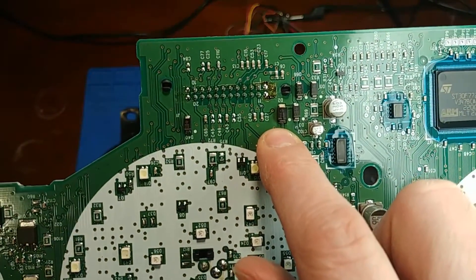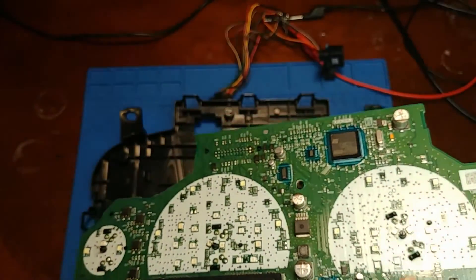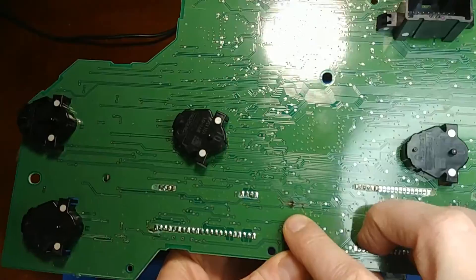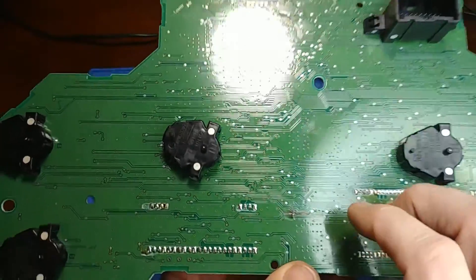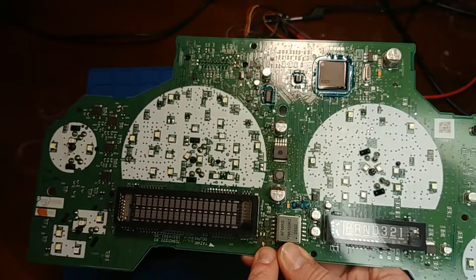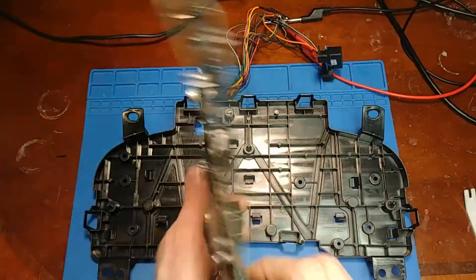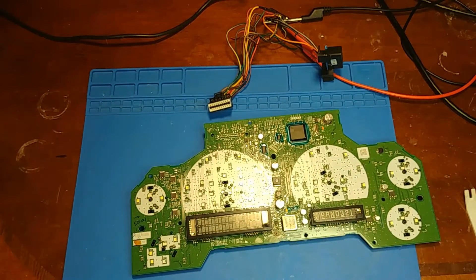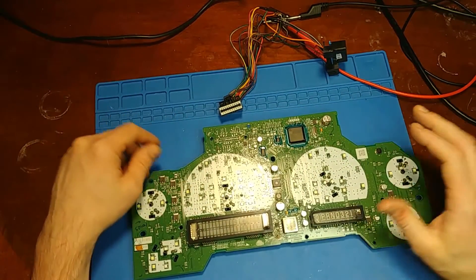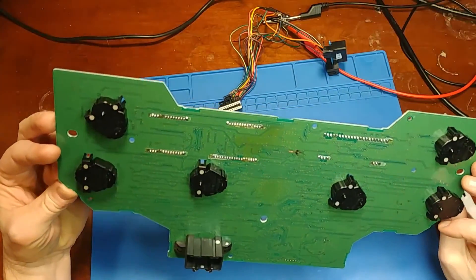I also see that the diode has split. So if you're replacing that, check out that 100 ohm resistor — it likes to take some abuse. Look at that — we have some blown open foil, got some foil hanging. I wonder if he accidentally caused a short and that's what caused the excessive current. Under normal conditions when this blows out it usually doesn't take out the diode and usually doesn't blow open foil. Normally the MOSFET shorts out and blows itself open and that's where it sits. But this one is a little more damaged than normal.